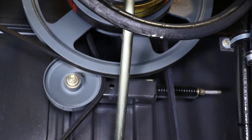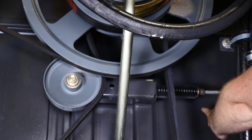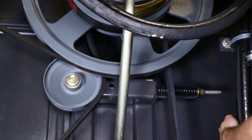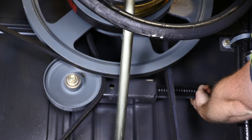I'm on the left side of the machine here and we're going to talk about the cleaning system drive. This one has a different style of tensioner. As you can see, we have our black spring here and then we have an indicator tab underneath. The proper tension for this drive system is when this washer here is even with this steel indicator.